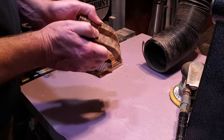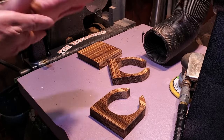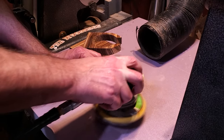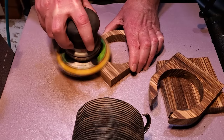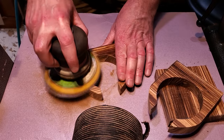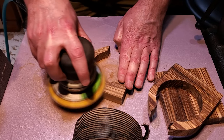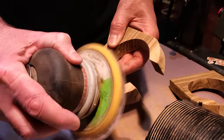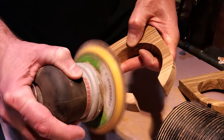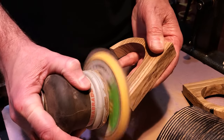Once I got that done I separated them and started sanding the outside. If you're going to use a router with a round-over bit, you want to do that before you cut the slot in the top — it will reduce catching. Round it over first before you cut the inch and five-eighths slot; it'll keep it from chipping out. I just went ahead and sanded them, got them all cleaned up, and softened the edges by rolling the sander over them a little bit. The same goes for the base, though you could definitely use a round-over bit with a router.